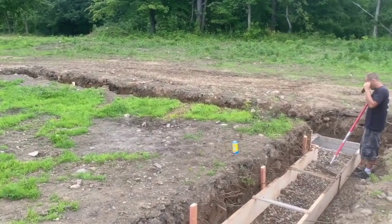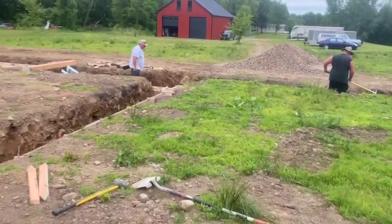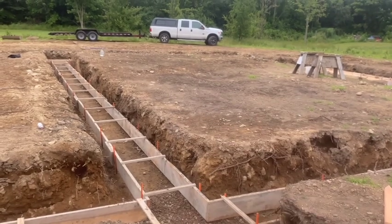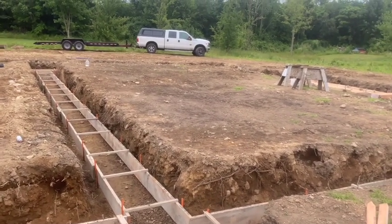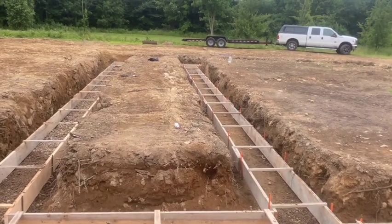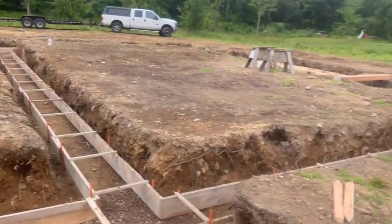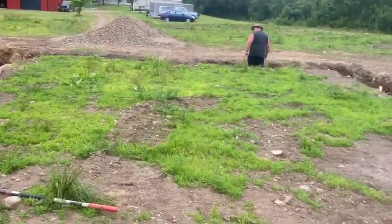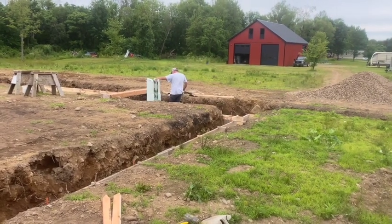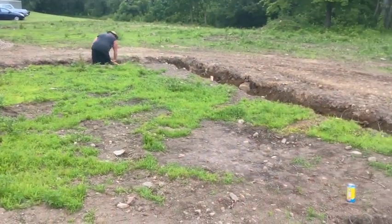It's going to be quite a bit of flat work once we get our Nudura walls up. The Nudura walls are only going to be two courses high on all of this. Then we've got basically a concrete slab that's going to be radiant heated for his house. Back here will be his porch - that'll probably be stamped concrete and will not be heated. The garage will be heated. Rick, the homeowner, is helping out, trying to give us a hand and save himself some money.